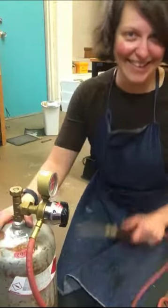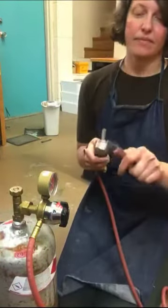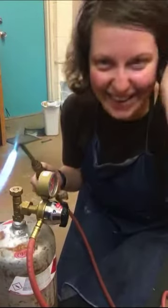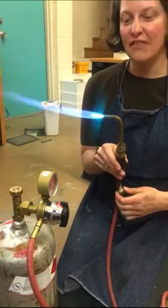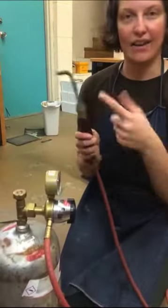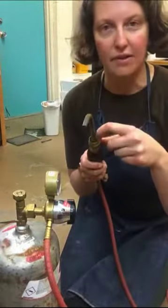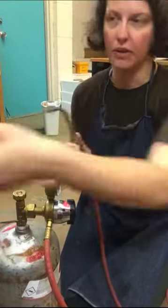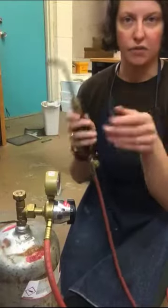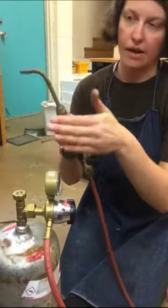Do you guys want me to light the torch again? Does anybody have any questions about any of the things that I've done? Oh, I have to turn it on to light it — duh. There we go; we can just sit here with fire on it. Fun tutorial on torches. All torches need gas and air. In my Prestolite torch here, the gas is coming from the tank and the air is coming from around the tip. These tips are all interchangeable — I've got smaller ones and bigger ones. The two mix together to make the nice refined point. If we were just lighting gas on fire, it would just be a loosey-goosey flame, so the air really helps to control it and make that sort of pinpoint flame that you see.